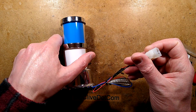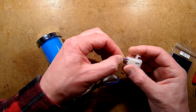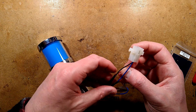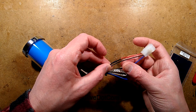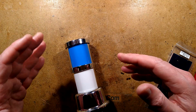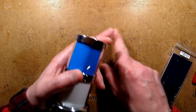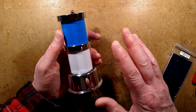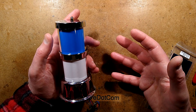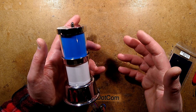The other connections: you've got three connections — the black which is common positive, which is odd, and then the red and the blue which are the two separate beacons. Each of them has a diode in series. With British gaming equipment, a lot of the lamps in the machine are on a matrix — a sort of XY grid of lights — run at a higher voltage and scanned. That lets them drive a lot of lamps from a small number of control lines in the processor.